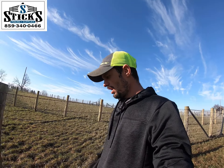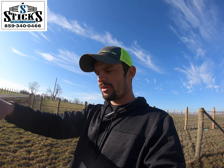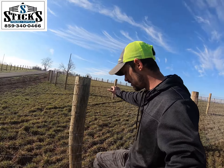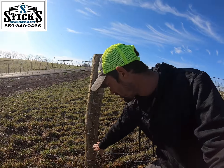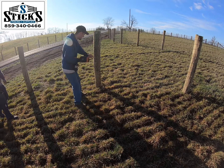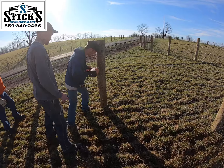So what I've done here is the bottom was a little bit loose and we went ahead and done the top. The top is this tight, then we went back down and loosened the top because it was extremely tight at the bottom of our curve and the bottom was just a little bit loose. So we just took our stretcher board and tightened it at the bottom one time and what it's created is a nice tight fence at the curve, and they'll go back down and staple these last few.